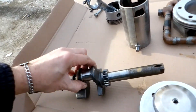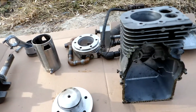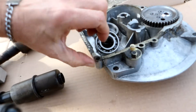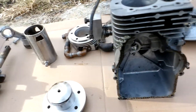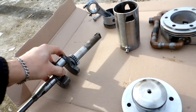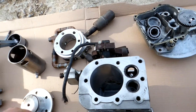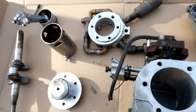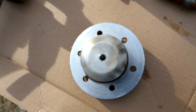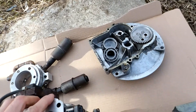This is the second version of this sleeve valve engine. The initial version used a one-inch spacer to house the sleeve drive — this one doesn't. On the initial one we had to add a second gear one inch down to accommodate that. This one doesn't have that, and it may be putting out over five horsepower now with less crankshaft flex. You can see some burn marks on the head near where the exhaust ports are.